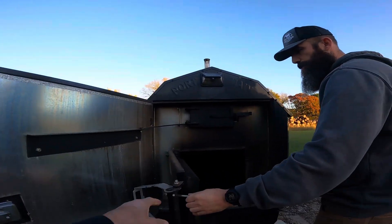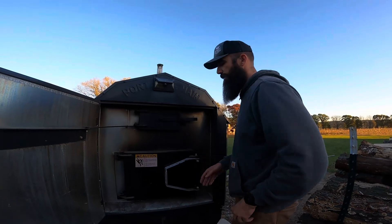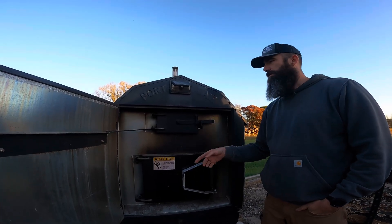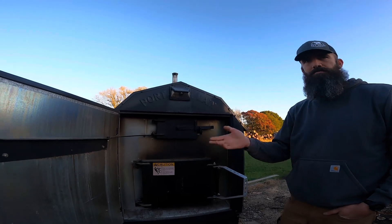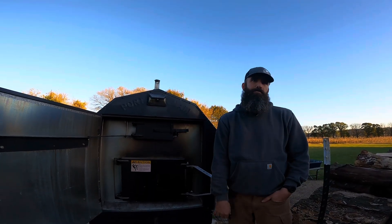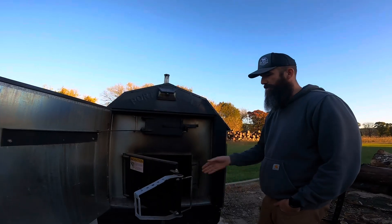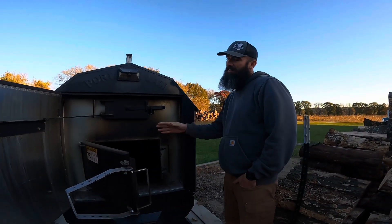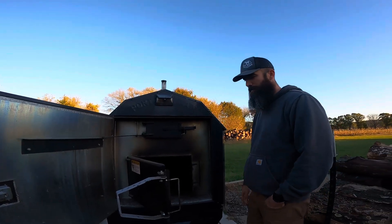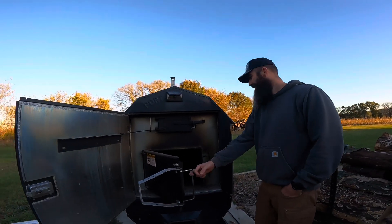The latch is a nice positive-locking design. When you're opening the door, if the fan is running, crack this door a little bit and shut the fan off first so it's not blowing everything at you. If you just come out normally, crack the door, get your wood stacked up, let it depressurize - that'll get the fire going again and then you open it right up. You don't want a flash burn - it can look like a dragon coming around the door, shooting flame out both sides. That'll happen with any boiler when you give it oxygen.